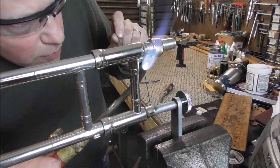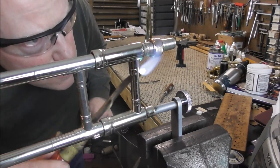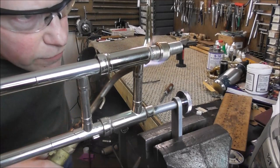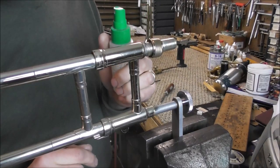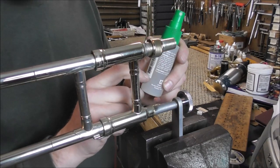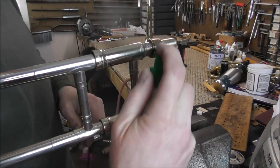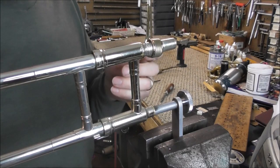You try your best not to burn lacquer, because it makes the job a lot easier if you don't need to do a lacquer touch-up job when you're done. I think I might need some flux right here, because flux may not have gone to the bottom. If there is no flux in a certain place, the solder will have a hard time flowing. The flux I used is acidic and it will eat away at the lacquer after time. So I'm going to neutralize that — I have a bottle with one quarter ammonia and the rest filled with water. I squirt that on there. It is still hot and sizzling because there's a lot of metal here — it's thicker, so it takes longer for it to cool off.